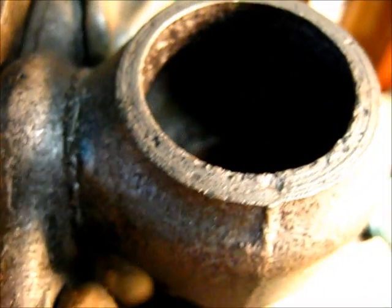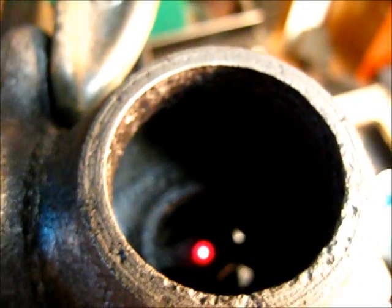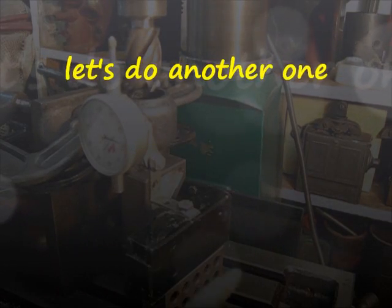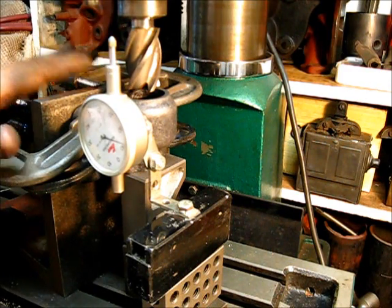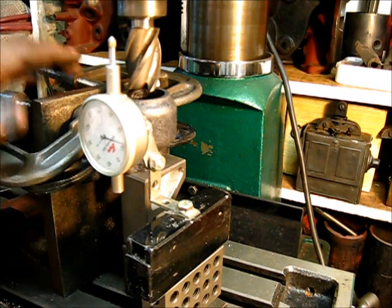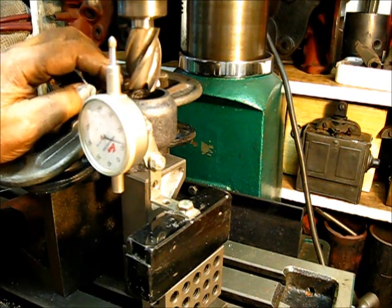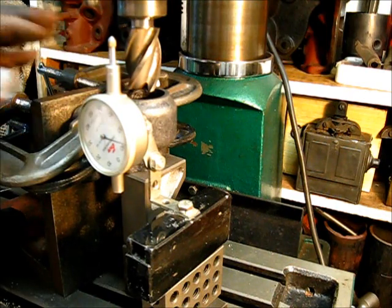A bird's eye view — y'all see that laser point down in there? It's on the center of that rivet. Now let's get a better light. The setup is: the end mill is back in the collet tight, the table is tight in all directions, everything's locked down. I do have the depth gauge set up here to alert me to how many thousandths I take off of that seat. This one looked fairly good — this is just a cleanup cut, so I'm just going to take about 20 thousandths off.